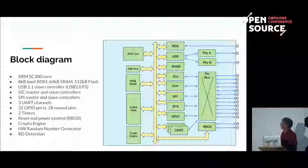It has a circuit for sensing a debug cable being plugged in, and then it brings to life a whole new personality of the chip, which we'll talk about later. There is a pin mux which allows connecting different peripherals to different pins on the chip. And there is the so-called Rbox, which is a subsystem that controls power and reset and is completely independent from the CPU. It runs at a very low level and contributes to the root of trust of Chromebooks.